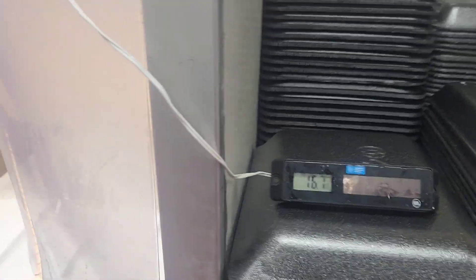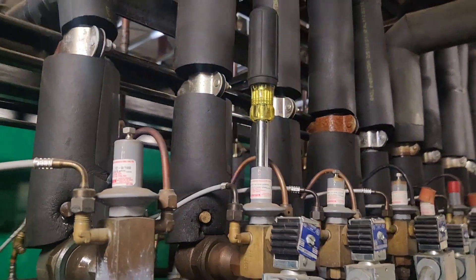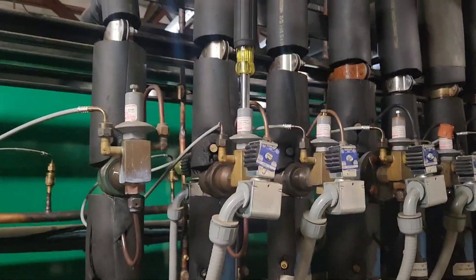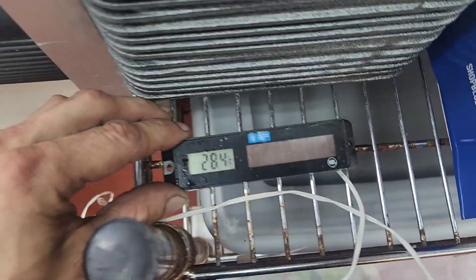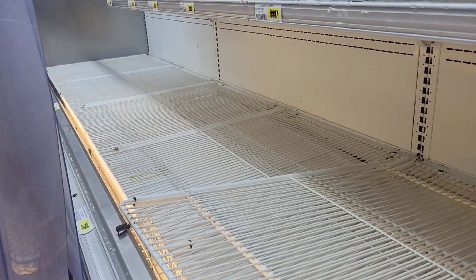Now finally I have low temperature occurring. I had adjusted the EPR, so that's why it's gotten even lower than it should be — I just need to do some EPR adjustments and then I'm done. Finally getting closer to where it needs to be. That's it — thanks for watching, like and subscribe to the channel. I appreciate the support, see you later.